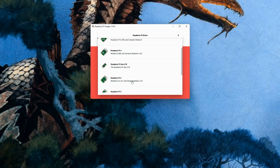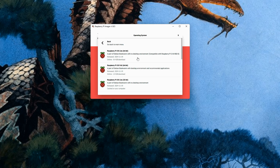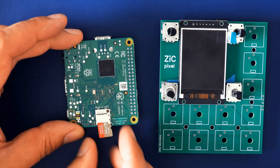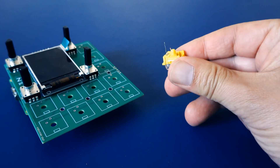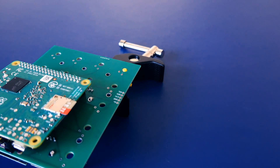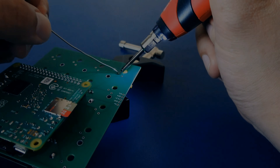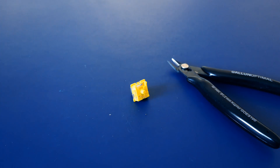Next, install Linux on your SD card using Raspberry Pi's SD card imager. Insert the SD card into the Pi 3 and push the Pi 3 into its place. Then solder all the key switches into place. I didn't manage to find the flat switches the build recipe called for, which prompted me to solder an extra wire to all of them to make them usable.